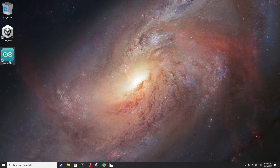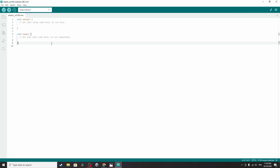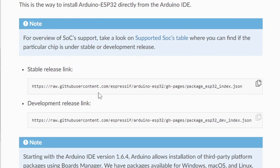You can open it up by selecting the option to run the Arduino IDE and hit Finish, or simply open it from the desktop. Now it has started — this is the first time I'm using the new version of the Arduino IDE. The interface is amazing and it's downloading some packages automatically. Before we start programming the ESP32 we have to modify the Arduino IDE. Let's go back to the website and copy the required link using the copy icon.